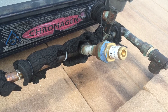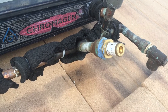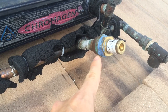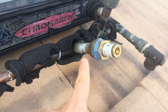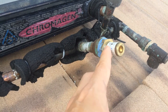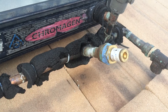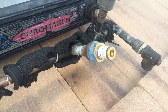If you're a solar water heater owner — a domestic water heater — you would see this very often in a lot of cases. What happens is, you see this valve here. This is an anti-freeze valve, which is supposed to work when it's cold weather. It will release the water from the system, allowing the pipe not to freeze. That's the reason why it's made that way.